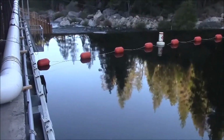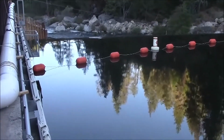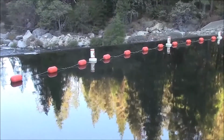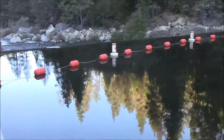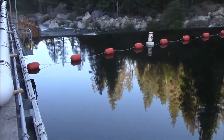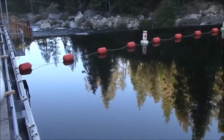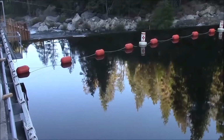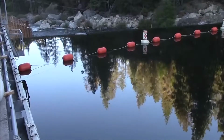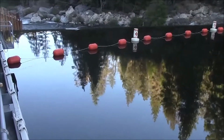The concrete structure is to my left. The work area is here directly in front, and the 16-foot tall AquaDam will be installed to the right. What may end up happening during installation is that smaller AquaDams are installed into the work area just to fill up the work area so that the 16-footer can be installed without fear of influence by outside water sources. The AquaDam can't move into the work area if the work area is already taken up with another AquaDam.